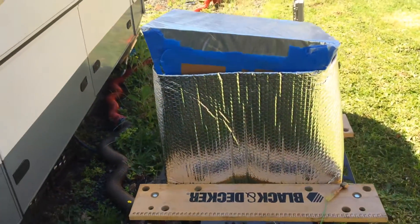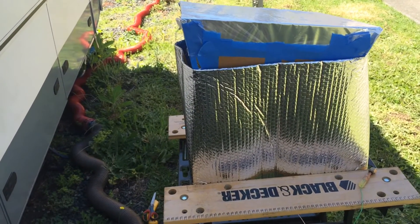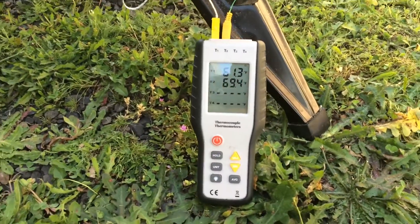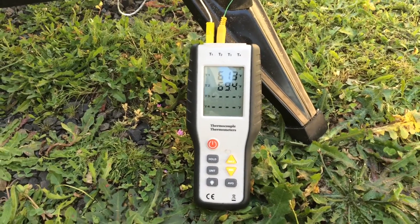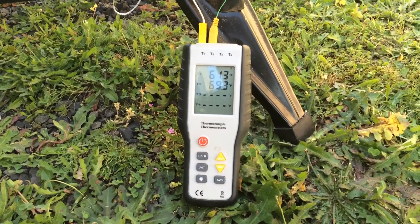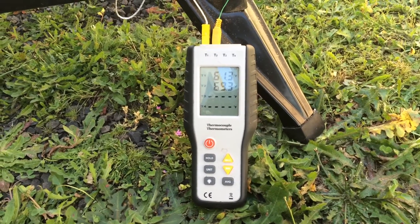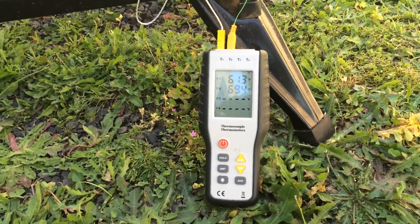I'm going to have to build a little better box for this — probably just a cardboard box that's somewhat insulated. I imagine I'm going to run out of suitable conditions to even play with it. The lowest temperatures I've seen were about 48. When I went around the corner to get the other thermocouple and came back, it was 48, and as soon as I approached the thing it spiked back up into the 60s. My buddy suggested just putting a thermocouple in there with no mass, and he was absolutely right — it just shows you how sensitive that thermocouple is.